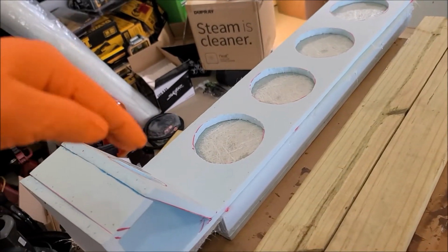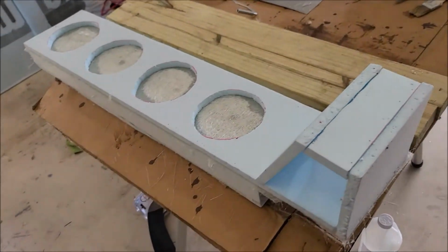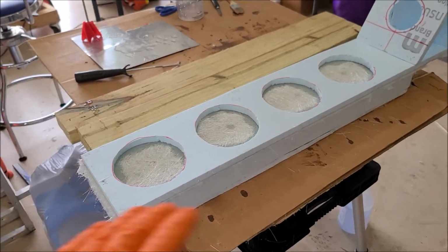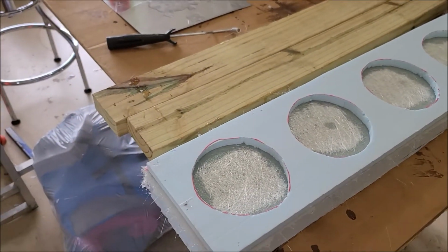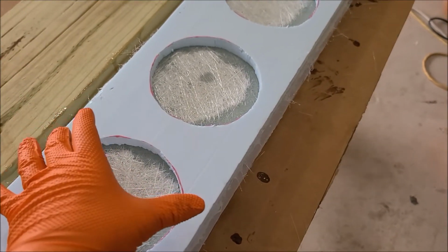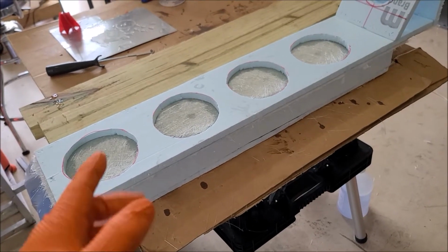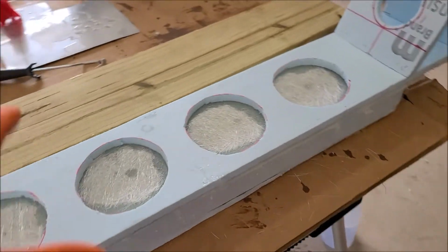I basically, in order to not have any wood in the construction, which is what I care about most, because I am going to be doing several of these on boats of people that I know. So we're going to be putting these on boats. They're going to be completely sealed with the epoxy inside and outside. I even go in and epoxy the inside of the speaker holes so that everything is sealed up. Nothing will leak into the foam, but the epoxy is essentially a glue, so it keeps everything together nice.